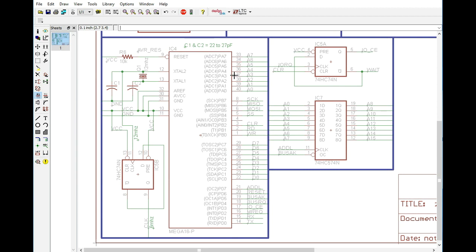So we're writing to a particular register. And of course, whatever data is on the data bus could also tell us what aspect of that IO port it wants. For example, let's say that you have the Z80 SIO. We'll use that again as a good example. You would write to the command register a particular address, and then whatever that address is, it would put that into the data register, and then you would read back out of that data register, and depending upon the bits that were set, it would tell you what the status of the SIO is.